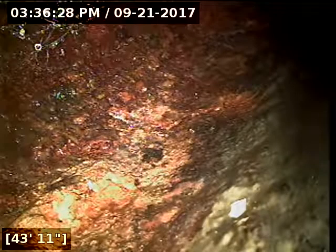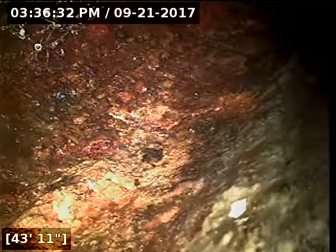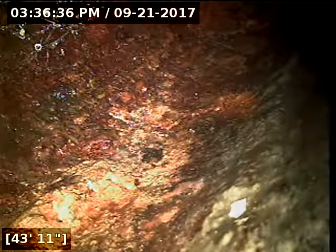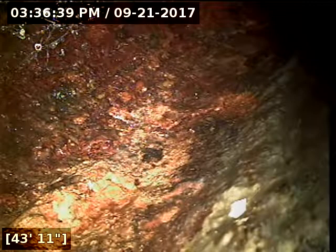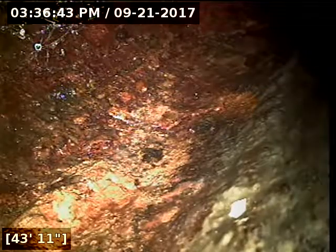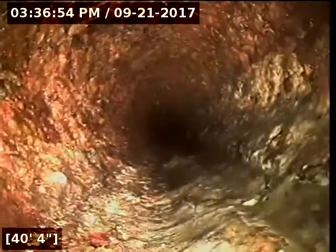All right, and the little trough here, we'll call it belly or worn out pipe, ends just so. This section of pipe here spans essentially the exact width of the vanity in that bathroom. It starts and stops at each side of it. So anyway, there's blue tape on either side of the vanity showing where, especially the arrow I have there. That's about as close as I can get to being on top of the line. Again, I cannot tell if the pipe is running under the wall or just inside of it. But I would recommend having a plumber take a look at that.